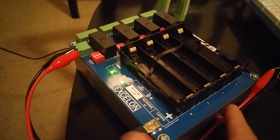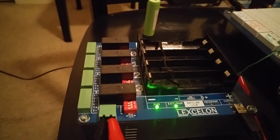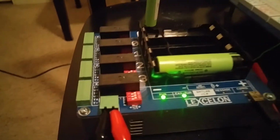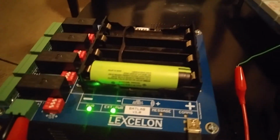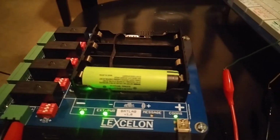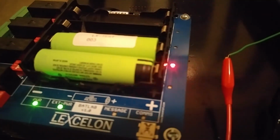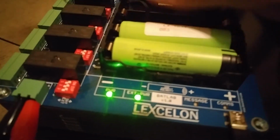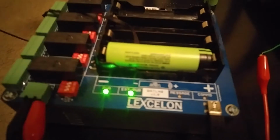That information is also documented in a Batlab hardware user's manual that is in the description of this video. So that can be used to see the different blink patterns, but just to demo really quickly with this device connected, if I were to take this cell right here and place it in with correct polarity, we would start to see the following blink pattern. If I took my second cell here and put it in reversed, which is not correct, we're going to see a separate blink pattern on the device. So that kind of gives you a heads up when things are going maybe wrong. If the cell testing has stopped for any given reason, you can quickly reference that. And if you're familiar with the blink patterns, you'd be able to know what's going on.